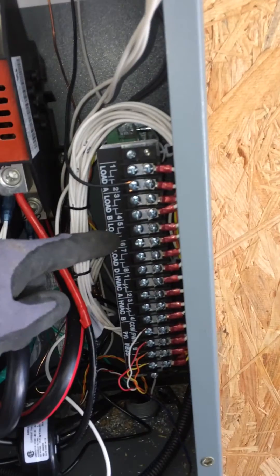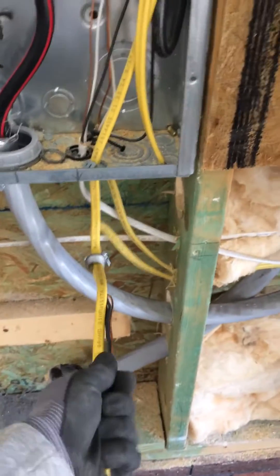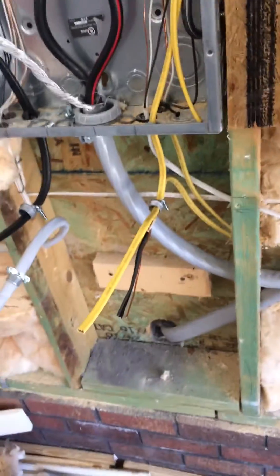My next loads, B and C, go to a 220 pump that we don't need in an emergency, and the heat and AC. We're doing it hardwired instead of running thermostat wire all the way back to the units, so this 50 amp line does all the heat and air. That'll open up last — and that's how you shed the loads.